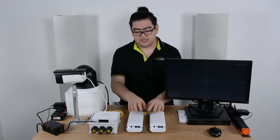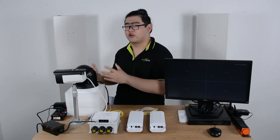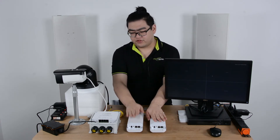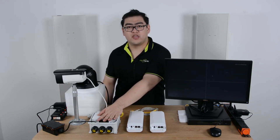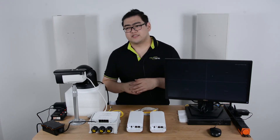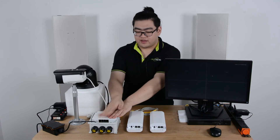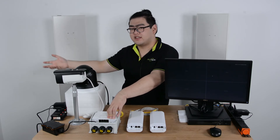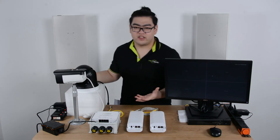Today we're going to use this to create an extended PoE network, maybe a thousand meters away. We'll use the wireless network bridge, and at the receiver side we'll connect to a PoE powered switch. The PoE powered switch acts as both power sourcing equipment and a powered device — it receives power and data on one port and then outputs power and data to IP devices connected to it, working as a small network system in the field.